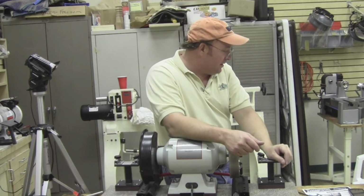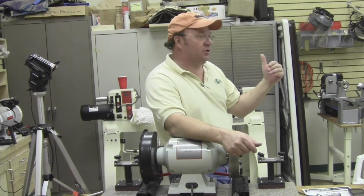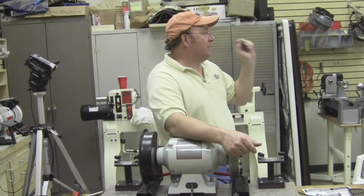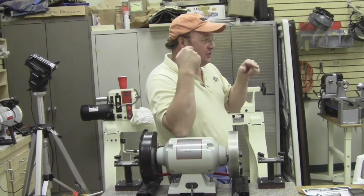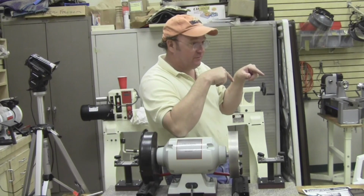Then you look at Mike Mahoney, it's the same deal. If you look at his gouges, he's still using a 40-degree edge, but he's grinding the heel back or using a secondary angle. The reason why they like that 40-degree edge, what I've found, is it's easier to start the cut than a 60-degree, and it's more aggressive.